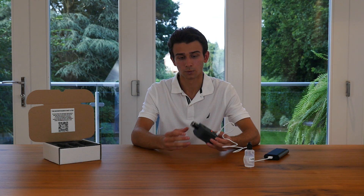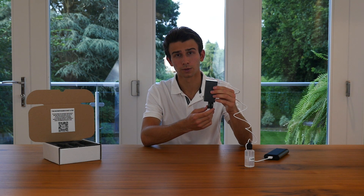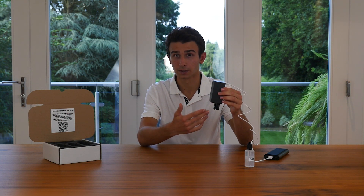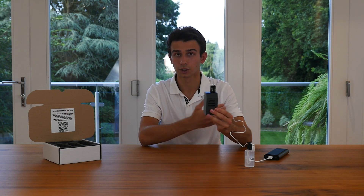While that's happening we can go ahead and refill the fog liquid tank, which is this little cylinder up here. It's always good practice to unscrew the fog liquid tank while holding the Microfogger in a horizontal orientation, because once you do have liquid in there, if you unscrew it while the Microfogger is vertical it'll just spill out.